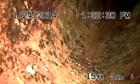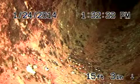Putting the camera back the other way. It is ABS plastic heading back, and then it transitions to cast iron pipe. The cast iron pipe looks like it's in pretty fair condition with minor rust buildup underneath the house. It continues going to the house and up into the roof bend. The cast iron has very minor rust buildup.